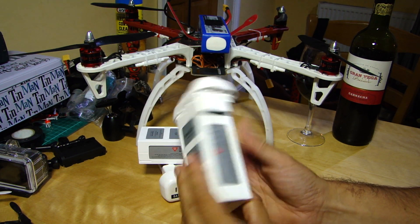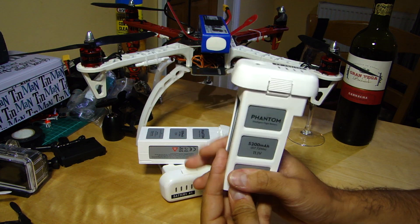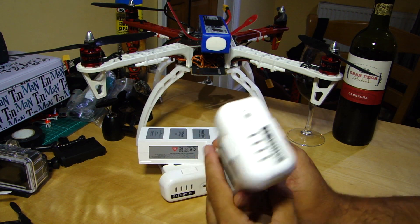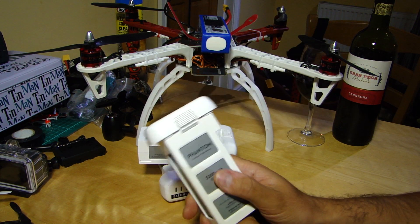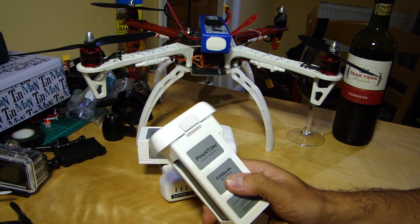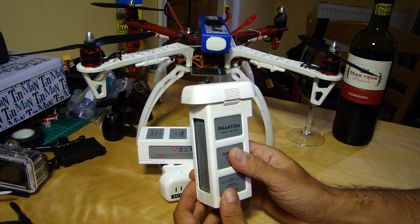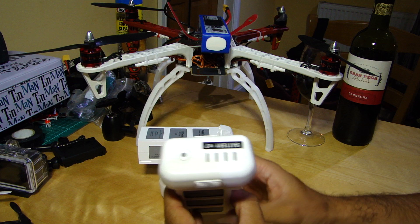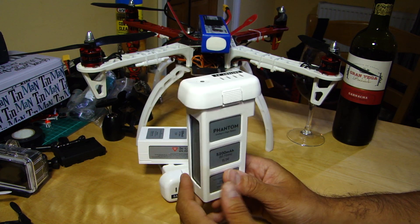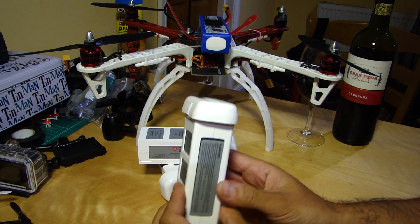On storage: LiPo batteries don't like being left for long periods fully charged, and neither do they like being left on low charge. There is a sweet spot somewhere around 40 to 55 percent charge, which is why when you buy your smart battery you'll find it's roughly 50 percent charged. In that state they can last for months and months with no deterioration in their ability to hold a charge. What I tend to do is if I've got fully charged batteries ready to go and the weather looks appalling, I'll leave it a couple of days then go fly — just hover in the garden — and get them down to half if I'm not going to fly for more than about five days. I've heard people say no more than 24 hours, and others say a couple of weeks, but five days works for me.